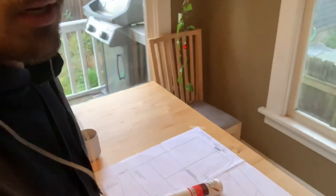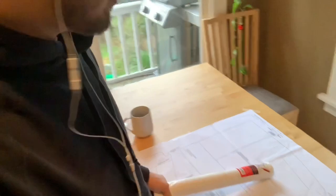And then also, the original plans call for an outboard motor up to 10 horsepower. But I want big zooms, so I'm probably going to get something around 15 to 25 horsepower. So I need to beef up the transom a little bit. I'll probably be using either 3/4 or 4/4 inch plywood rather than just the half inch plywood. And then maybe beefing up the transom knee.